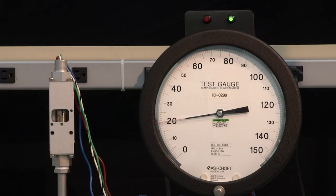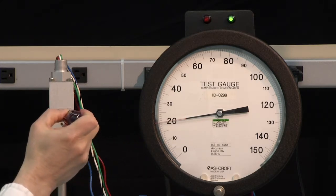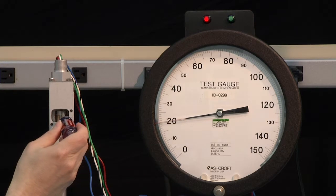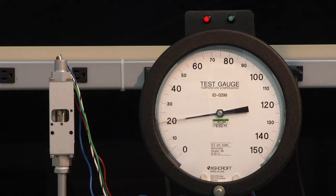Now the switch just turned on. So what we are going to do is go back clockwise until the switch turns off — that will be the light turning red. And the light just turned red. Now we will go down and measure the set point. We will always go back to zero on the decreasing set point, and then to full range — back up to 100, and then back down. We will measure the actual set point, which is just 20 now.